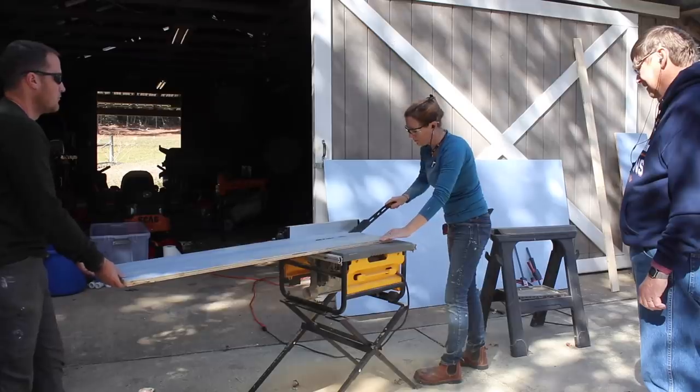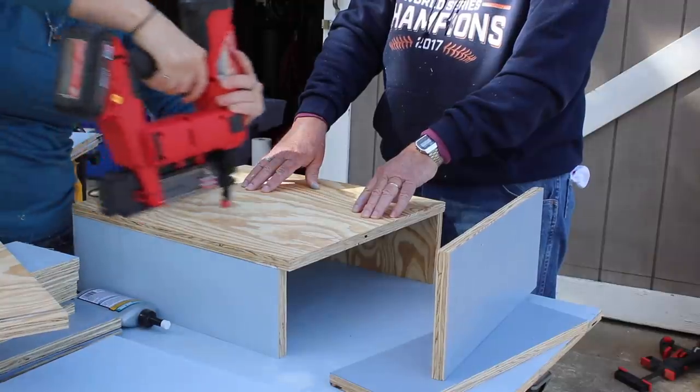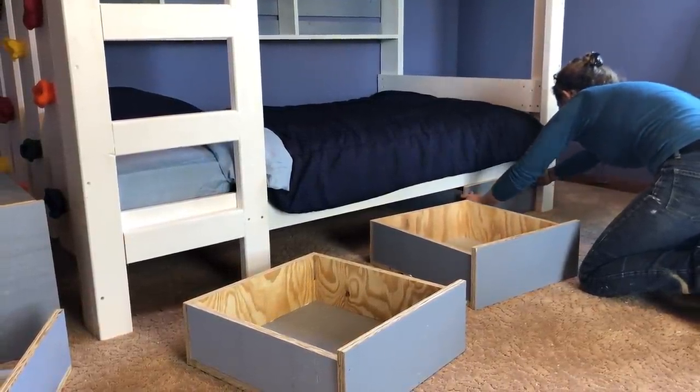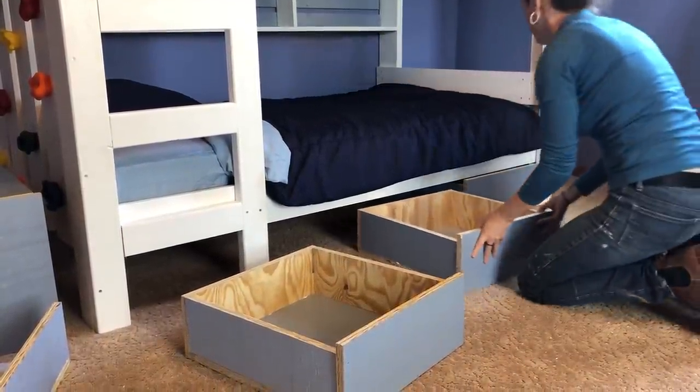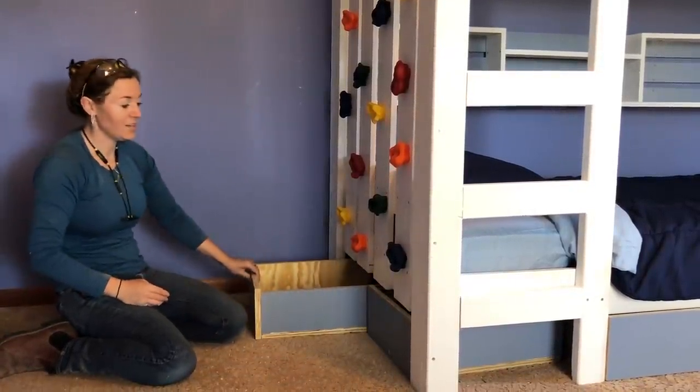The last feature I tried to include was adding drawers to the bottom of the bunk bed — there is so much wasted space here that drawers are perfect. I did some simple drawer assembly using Titebond Quick and Thick and a brad nailer. Since my brother has carpet in the room the drawers don't have casters but will slide on top of the carpet. If you have tile or hardwood, shortening the drawers is a simple adjustment so you can add casters. I was really pushing my limits getting to the airport so I wasn't able to put handles on the drawers and there's some touch-up paint needed, but all in all not bad for two and a half days of work. I love how involved the entire family was, especially Noah.